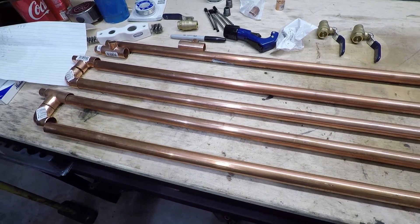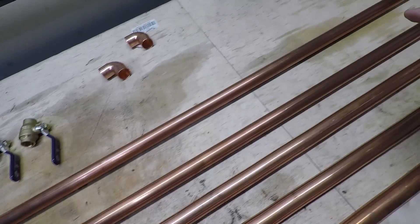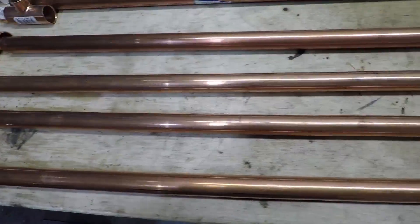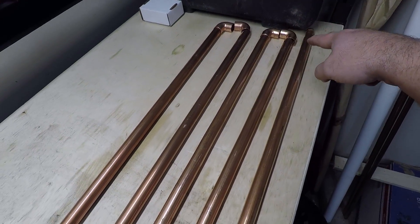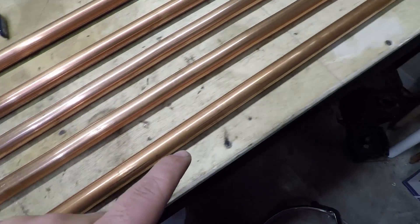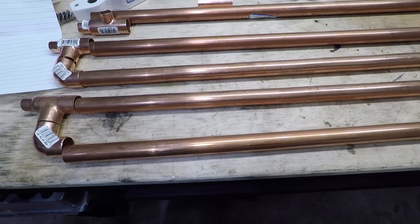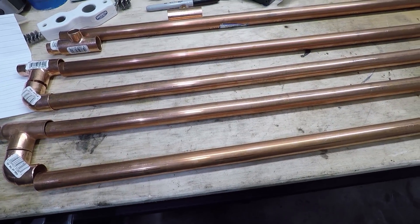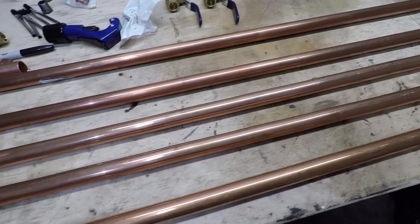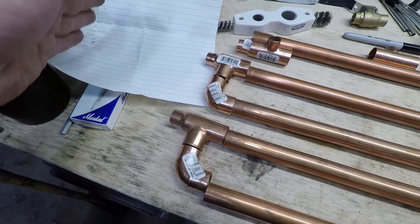So here's the goal. I am going to pipe the air coming out of my compressor into this T. There's going to be a little valve down here, and the air will come up to the top, come back down over here to the bottom. There will be another valve here, and then the air will have to travel back up, up over here, come back down to yet another valve with a leg on it, and then back up. It will discharge out there on that top end. This really isn't an air dryer — it's going to be an air water separator. The goal is to get the water to condense inside these pipes, inside this copper tubing. It'll cool off as it's going through the tubing, so the water will condense, fall out of the airstream, and end up down at the bottom where I can drain it off with the valves.